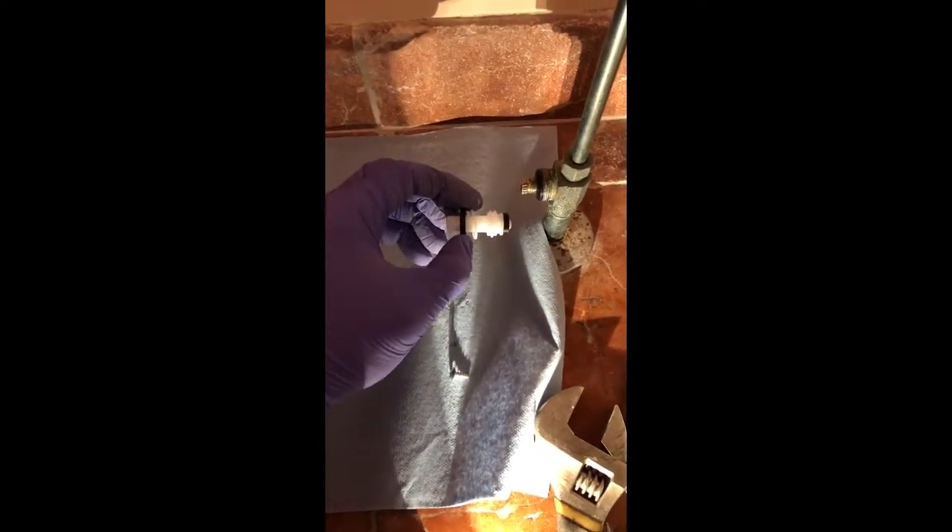I have put the pieces in order so that when you unscrew the old one, you just pop the new one in and you won't have too much water spilling on the floor. I have turned off the water, but there's usually some water left in the holding tank as well as the line itself. The way you get this valve out is you just unscrew it counterclockwise. If you can't do it by hand, you can just use the handle — put the handle on, you don't need to put the nut on — and just unscrew it until the valve comes out.